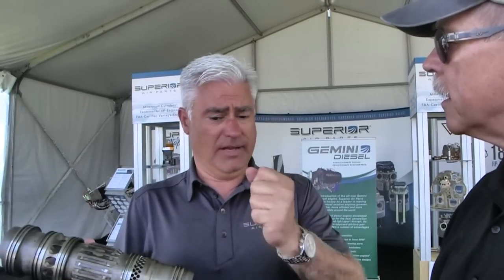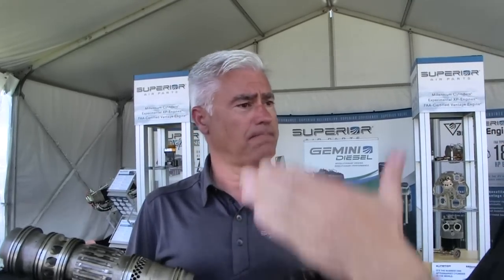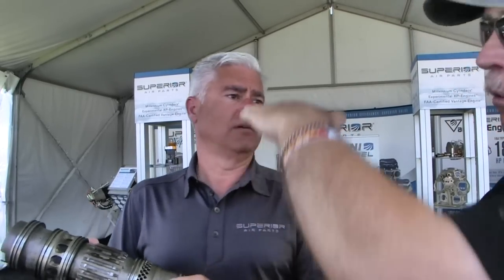Torque is a big deal on diesel engines. How does this one compare? It has a very flat torque buildup. That's good because you can reduce power in terms of RPM and still have significant torque. With a shallow angle you can pull back further. So for endurance flying, spending time aloft, this is a great power plant.